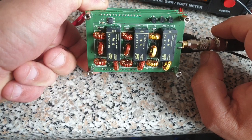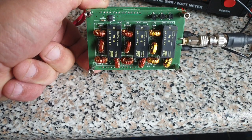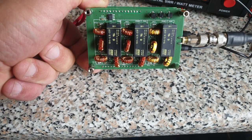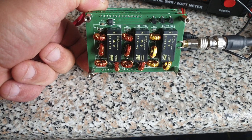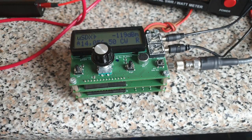The latching relays are three volt types. Why? Because we are putting two coils in series. Those are latching relays — they have two coils, one for setting and one for resetting, and they are in series. So basically it's a six volt relay with one coil now, and you reverse the polarity of the coils — the datasheet said it would require lower current that way. By using latching relays, we only need current while switching, so for 15 milliseconds while changing band. Otherwise, this thing still consumes only 50 milliamps in receive. Perfect portable radio, low current consumption.